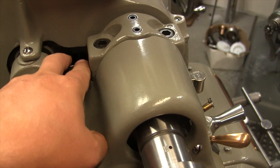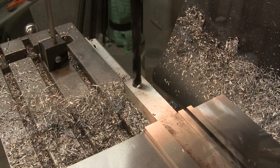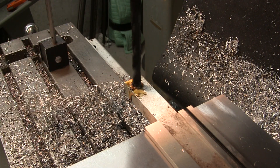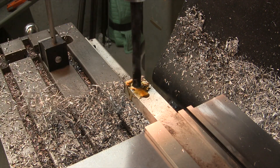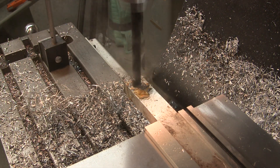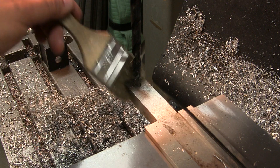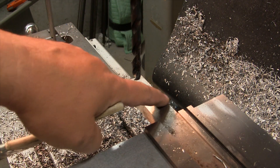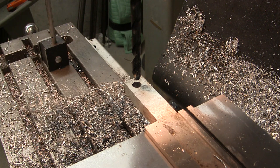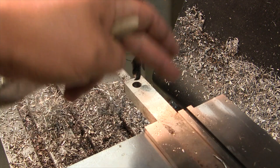I'm going to take some measurements now and fabricate a piece with a hole we can adapt into — bolt it down and make this piece. We're beginning by drilling a 7/16 through hole to accept the bolt. Now I'm going to deburr this edge and the hole, then mark it and cut it off in the bandsaw down to length. Then we'll bring it back to the mill and get it set up to put some mounting holes for the piece that stands up tall.